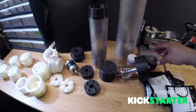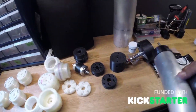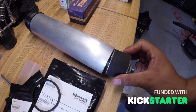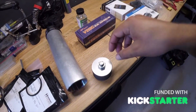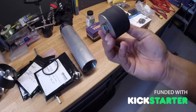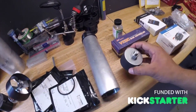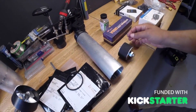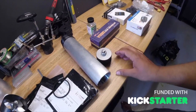The motor side is all sealed with O-rings and shaft seals. The other side uses a giant rubber bung/cork — when you slide the nose cone on, it slides inside. I drilled three holes for the three motor wires to come out, then you slide it in and tighten it, and the rubber squishes. This is a high-quality one rated for 150 PSI, which this will never reach, so it works very well and is very watertight. We could probably cut it in half to make it more streamlined — it's pretty big and heavy — but one step at a time.